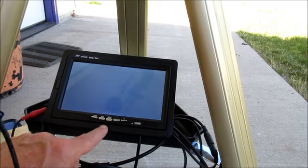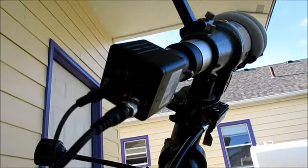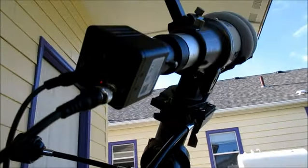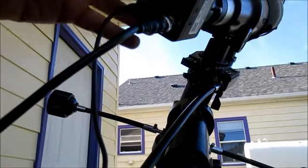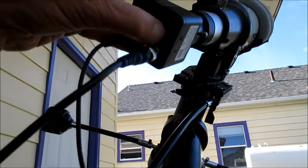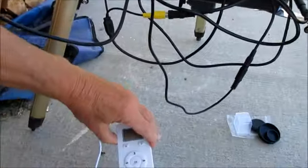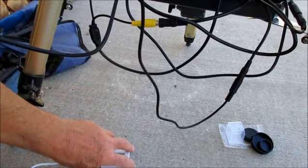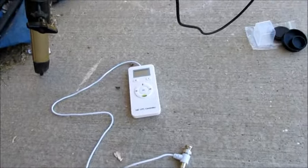The next question is, do we have any of the other sensitivity controls? Now, one thing I did to simplify the interface and the cabling was to actually remove this from the harness of the video controller. But I'm assuming I have these buttons here to do that. So let's push a few of these buttons and see what comes up. I don't seem to be getting any menuing options. So I have to assume that I was a bit hasty in removing this manual control. We will be needing it when we actually use the scope. Manual control right there. Here we go. I'm going to reinstall that.